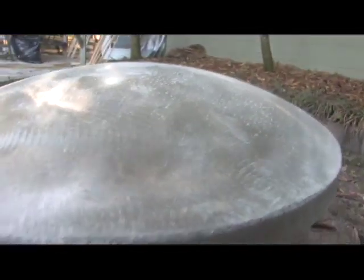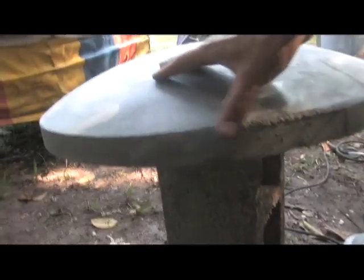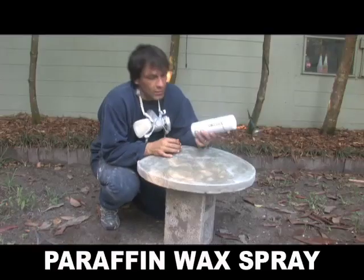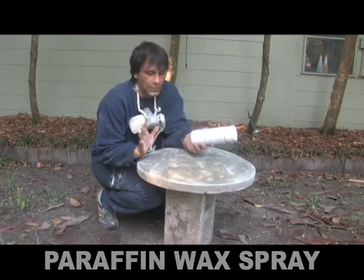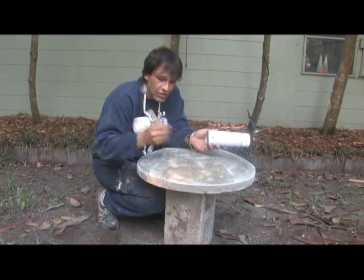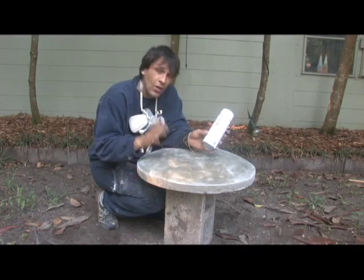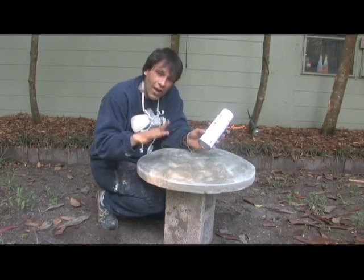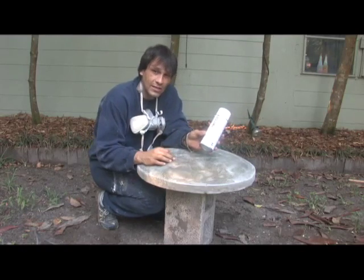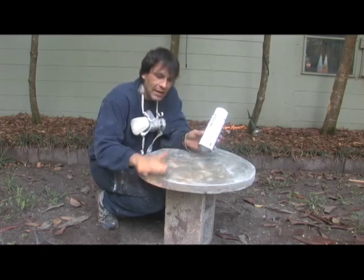So you should have something that ends up looking like that — it should have kind of a shiny glaze to it. What this is going to do is seal a lot of the pores of the concrete, making it a lot easier to work with, because popping the mold off a parabolic shape is very difficult — it's probably the hardest part of the entire process. A little bit of this spray goes a long way, but for the first time treating this, you want to put a lot on and make sure it sinks in good. Then we're going to use a buffer or a rag to rub it in, followed up with regular candle wax — paraffin — to get a nice glaze. The more wax you have between the concrete and your fiberglass resin, the easier it's going to be to pop off the mold. You want a nice smooth waxy finish, no clumps.